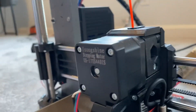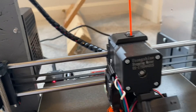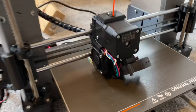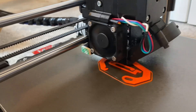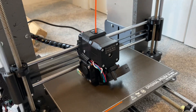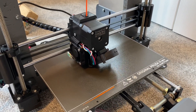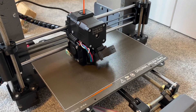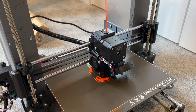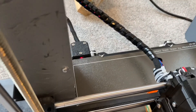There's better airflow with how the hot end is assembled and you can see the cooling fins of the hot end through the part, so I think that's better. The new fan shroud puts out a lot of air on the parts, and I've noticed that for prints with any bridging or unsupported overhangs they just come out great — it's amazing.